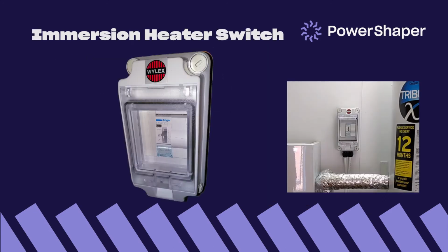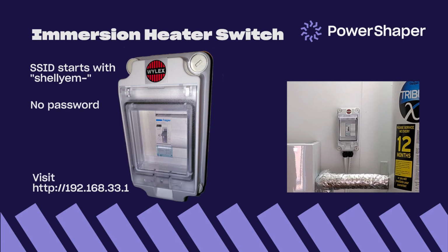So we'll start with the immersion switch. As I've said, this puts out a Wi-Fi hotspot of its own, which has an SSID starting with Shelly M. So go up and connect to this using a laptop or a mobile phone. There will be no password required. There won't be the internet connection through it, obviously, but you should be able to reach its own interface by going in a browser to